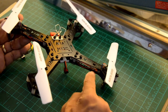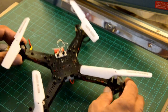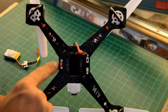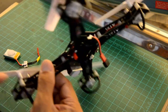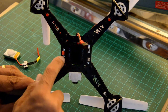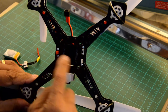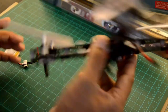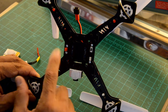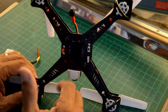The hardware you see is for the nylon spacers holding the two frame plates in sandwich form — very lightweight. The charging connector is already mounted and screwed into the case from the stock product, so I just reused those parts. I did use slightly longer two-millimeter screws. The existing camera that comes with the JJRC H12C is a two-megapixel camera — not great, but usable if that's all you have.